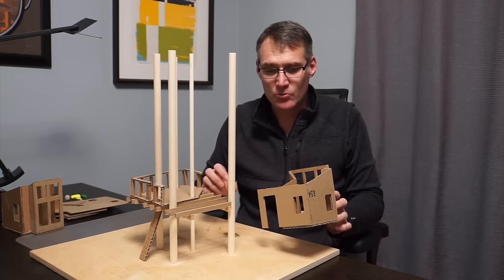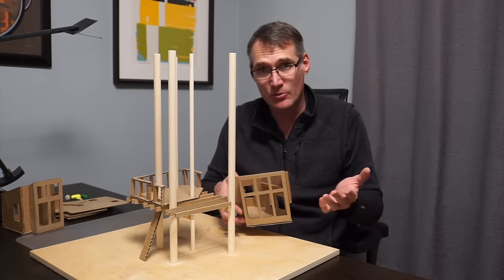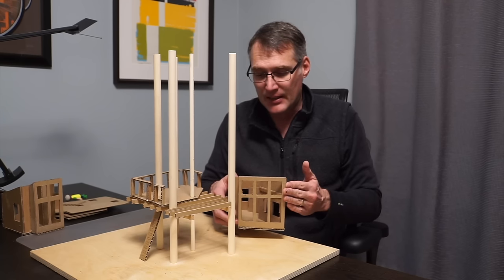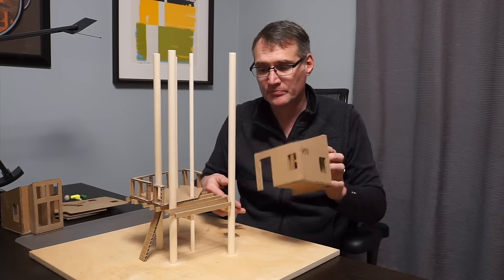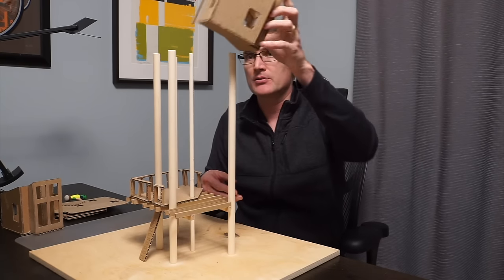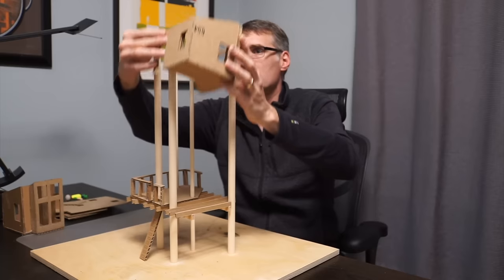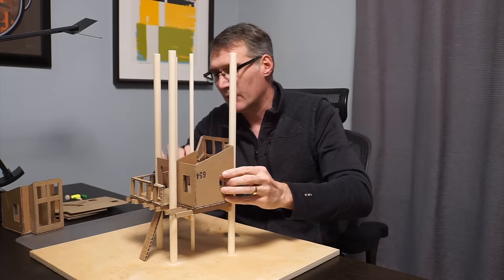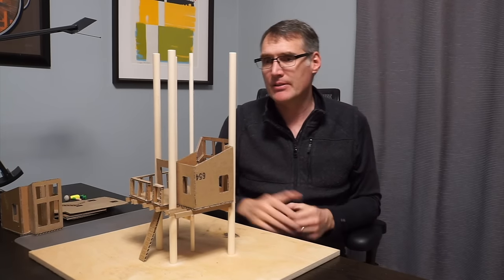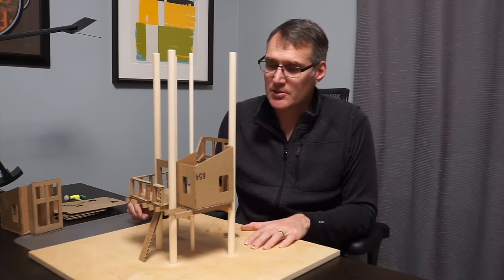simple. The design was built around the windows rather than designing and then buying the windows. We actually found salvage windows, and so it really depended on keeping the dimensions based on what we had. And in addition, we had to design around the local zoning requirements. The zoning officials in the area are relatively strict. And because of that, we had to limit the size of the indoor portion to about 75 square feet so that we could avoid any need for building permits and inspections. And so that's what we did.